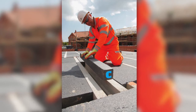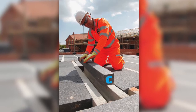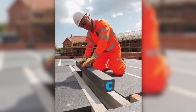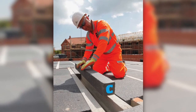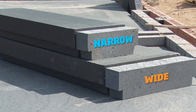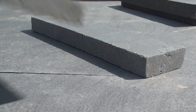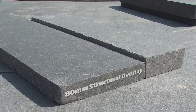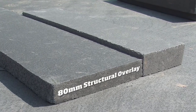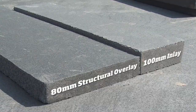In the cut tolerance joint area, use the 100 millimeter deep polystyrene sheet cut to width instead of the polystyrene blocks. Only gaps narrower than the narrow block can be filled in this manner. The blocks should never need cutting to width. Do not confuse the 100 millimeter thick inlay sheet with the commonly used 80 millimeter overlay sheet — the overlay sheet is structural grade; the 100 millimeter sheet is not.